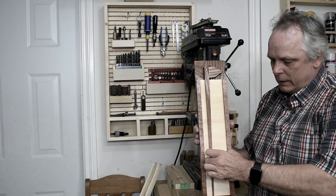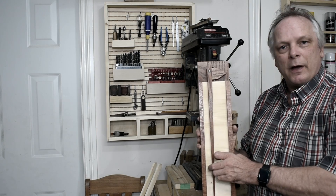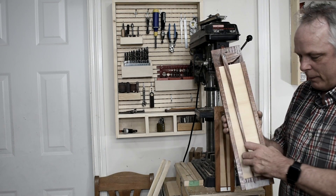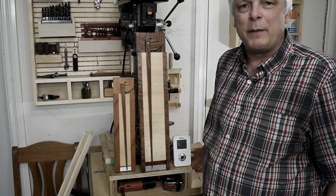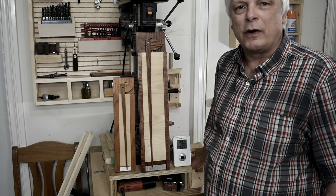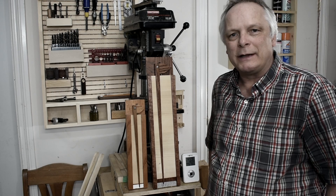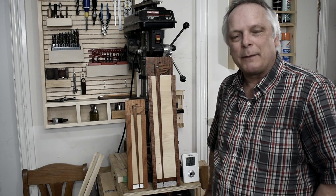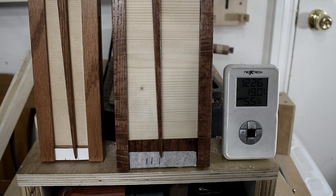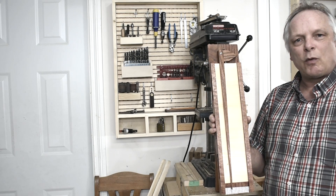My moisture meter is complete and I can check it every morning when I come into the shop and see where the humidity is based on the movement of the needle. The smaller one I made moves quite a bit — in the winter it dries right out, and in the summer it can swing right up really high. As a piano technician, that gives me some information about how pianos are behaving. When pianos are very hydrated and full of moisture they tend to go very sharp, and when they dry out they go flat. It can take hours or days for wood to absorb and release moisture. I put this in my shop, inside my house, and outside, and I got three different readings right away within one day. Thanks for watching and we'll talk to you guys soon.